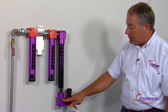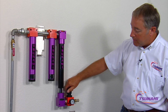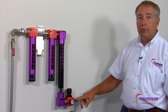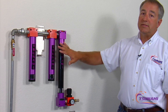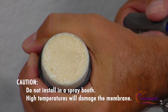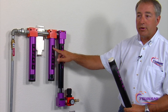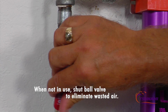The dry air is coming down through here. What we'd recommend is putting in one of our regulators — the kit includes one — and you would set this regulator to maybe 20, 30, or 40 pounds of pressure, whatever the minimum pressure is needed to do the painting. The higher the pressure in here and the lower the pressure here, the better the operation of the unit. But it's a complete package. One thing you would not want to do is mount this inside a spray booth where you'd be baking, as high temperature will destroy this membrane. Oil will also kill the membrane, which is why we package our system with a large oil coalescer to keep the oil out. It's a very simple system, and you're not wasting air when your equipment is done.